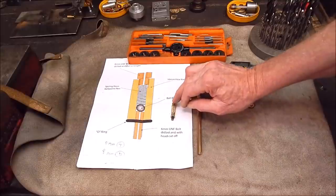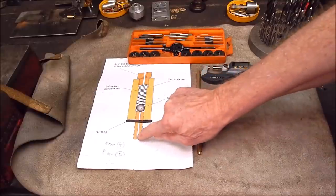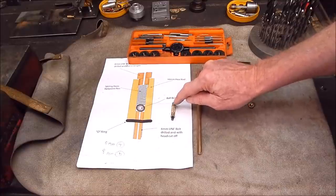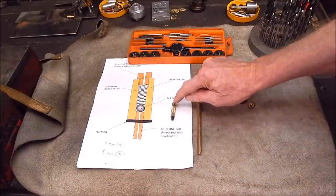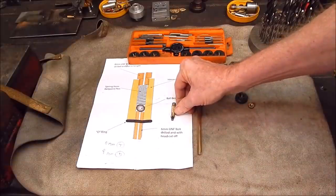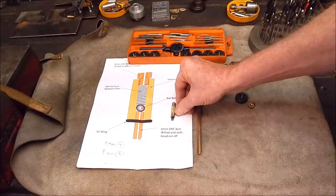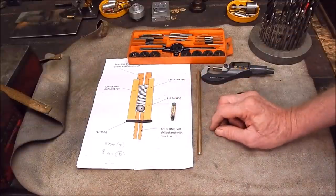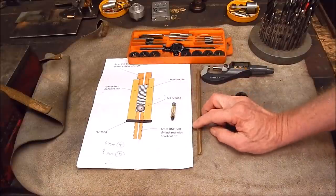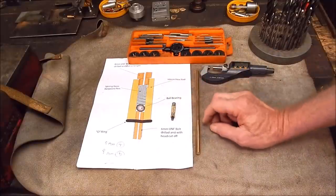The idea is to drill right through the brass at this small centre diameter, then drill down for your 5mm adjusting bolt and stop about where the knurling finishes. Then have the seat in the brass, so it would be steel on brass rather than steel on steel — less chance of them rusting together, and it would bed into the brass better, even though this doesn't leak as it is.